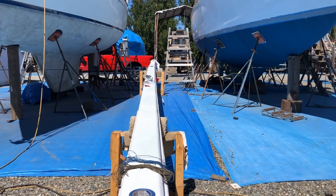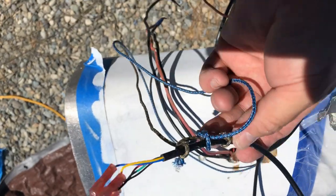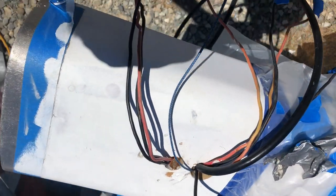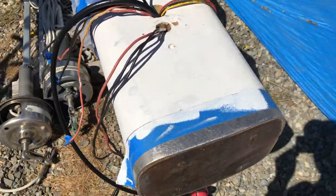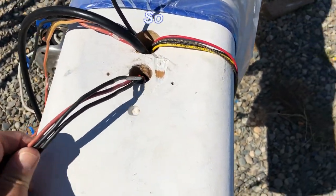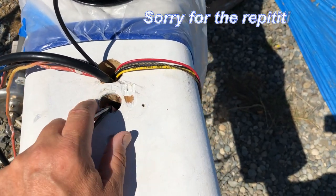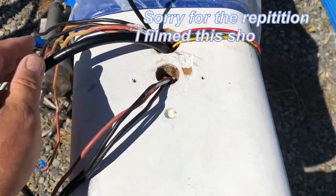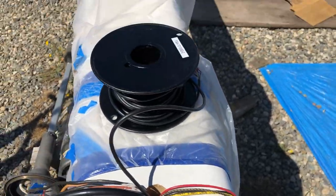Next is the navigation cable — the Raymarine cable. I was able to snake the instrument wiring through and the connector is intact, though it's getting a little messy in there. I think I've finally figured out my mast wiring problem. Originally they all came out one opening, and we drilled a larger one-inch opening. Now we have the new fat RG8 cable for VHF and AIS, and the new Raymarine instrument cable with lots to spare.